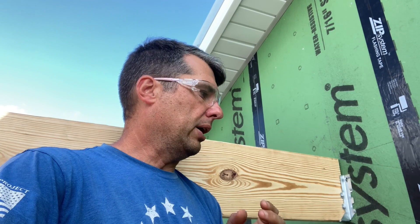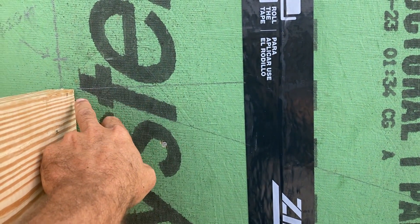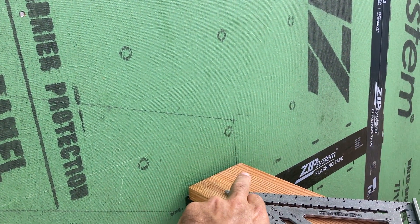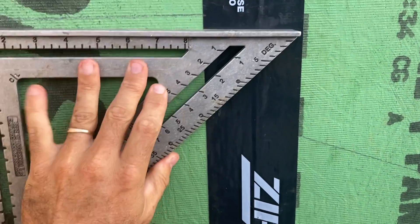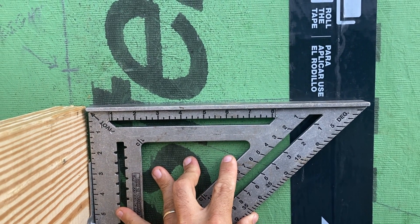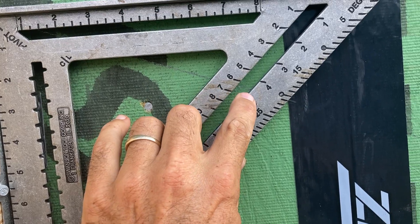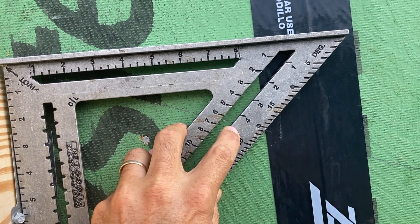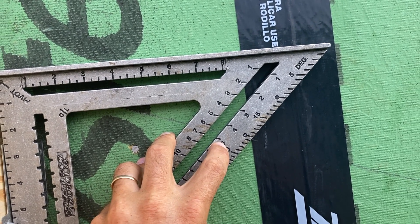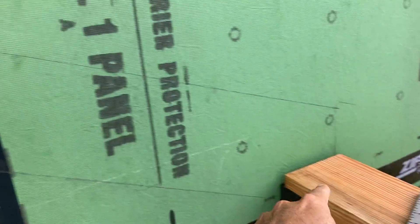First thing I wanted to do was figure out my roof pitch, because then I can make the majority of my cuts on my rafters. For my hieroglyphics on how I figured the roof pitch out — I took a level line off the top of my ridge board and then I drew a line from my ridge board down to where my rafter was going to sit on this timber with the bird mouth cut. I put my square on this level line and then you can look down at where the line runs through the common line on your speed square. Common is the bottom, and you can see the line that runs through — it's just a little over four and a half, maybe four and three quarters on the roof pitch. So that's my pitch that I need to cut my rafter angles at, both the angle at the top and the seat cut down there.